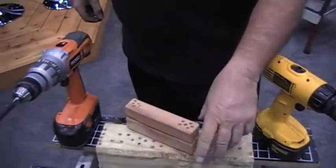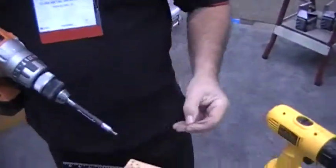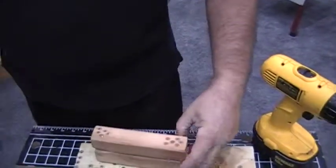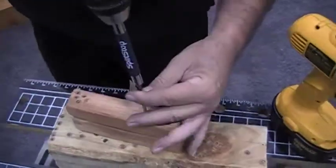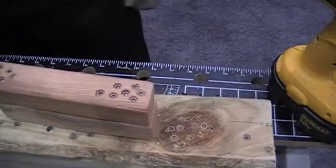The other advantage is the fact that it doesn't split — you get very few splits ever with a split-stop screw. Here's a piece of 2x2 baluster stock. The bottom piece has a pretty good size knot in it. This is not even full 2x2. You can see I'm getting a number of screws all driven into that 2x2 without a split.